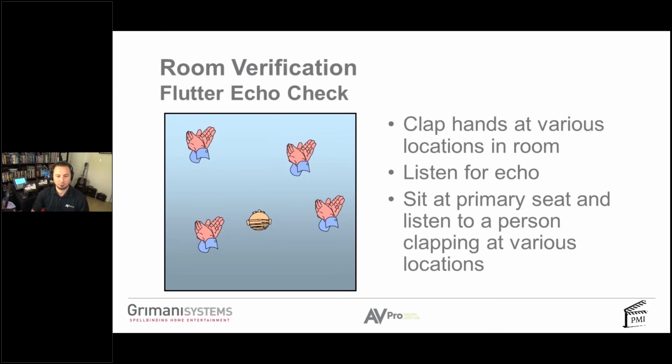And I've had the mixer listen to his program material and put up an absorber panel to get rid of the slap echo. He goes, oh, what'd you do? The sound changed. So again, there's a slap echo away from where the listener can hear it, or you have to stand behind the mixer 2 or 3 feet and clap your hands before you hear it. Every time the sound hits back and forth between the walls, it creates a little diffraction, a little scattering, and that multiple echo is going to screw up the sound quality. You should make sure there isn't too much of that.